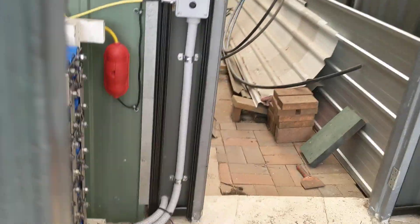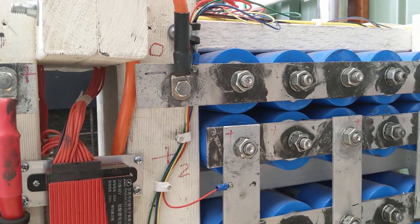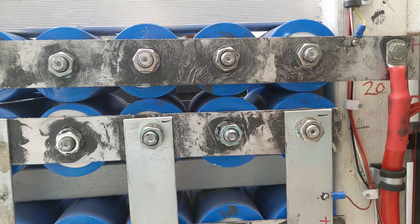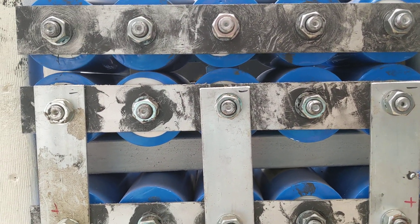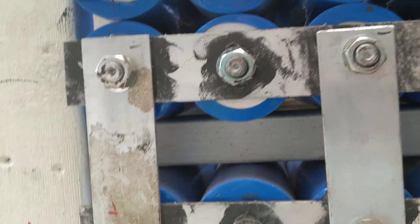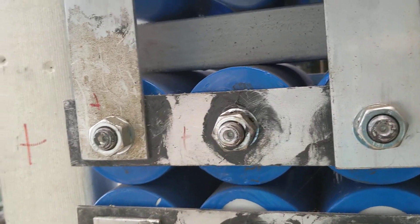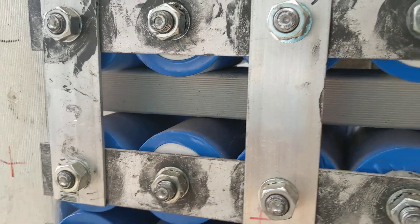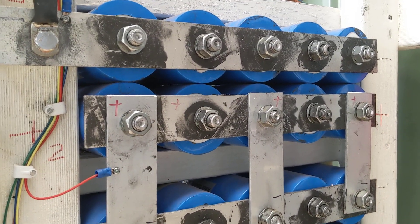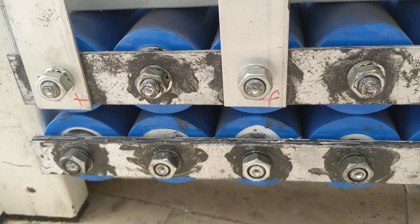You may have noticed smears of black stuff all over the place — here's an interesting trick. People often mention that aluminium bus bars are great except for the fact that they get surface corrosion as they naturally oxidize with exposure to oxygen. So I cleaned up every surface around where they were going to connect, and immediately applied a conductive grease. This conductive grease stops the oxidization and helps improve the contact between the bus bars and the battery terminals. I've done that all the way around — it's quite messy and takes a little longer, and doesn't look pretty, but it keeps the conductivity of them constant, which is something you really want.